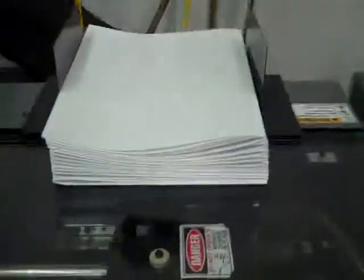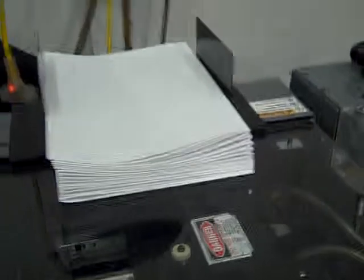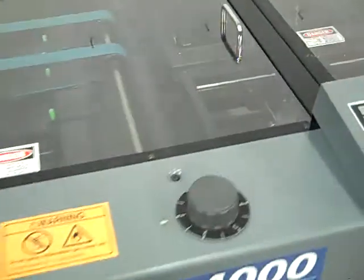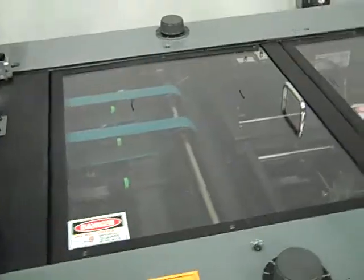It's all long grain too. If we were running short grain on the cover, or short grain paper, you'd have an even flatter looking booklet — but that's really a lot better than it would be if you were just trying to run it without the press. The 4000 Booklet Makers are known for doing a really good job on folding; they have three sets of fold rollers, six rollers total, plus the trimmer has a crusher on it as well.